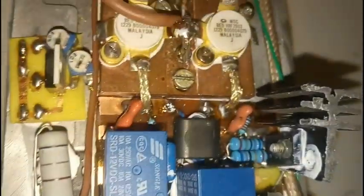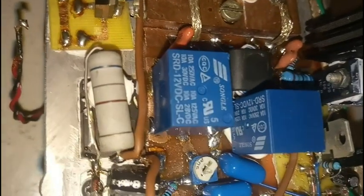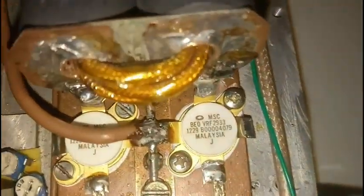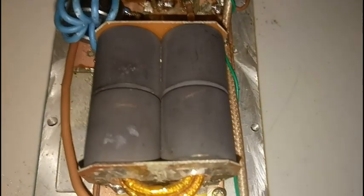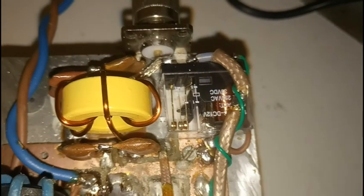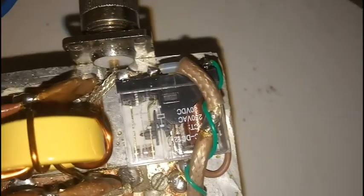Here you have a regulator which transforms 50V of the power supply into 12V to command the relays. The transistors are in push-pull, and the output transformer is a pig-nose transformer, as described in the PA0FRI site. The output filter is a one-cell CB band low-pass filter, and the output relay — you can see there — is an OMRON able to withstand the output power.